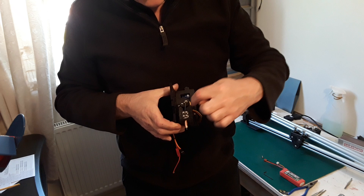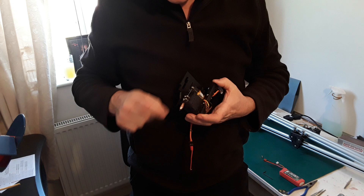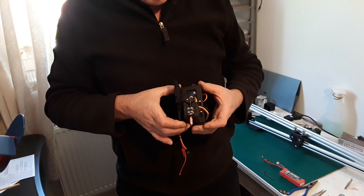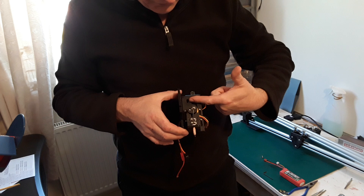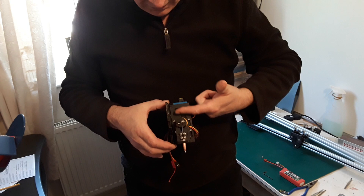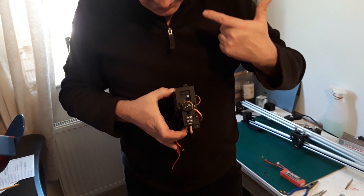The bearings are attached with M3 12mm screws going into the plastic, coming through into a MIG welding tip — I'm sure a lot of you have seen these tips on welding machines. I'm using that as a support for the actual needle. On the front you can just see a 9-gram servo, one of those cheap Chinese 9-gram servos you have on your foamy electric planes. When the servo arm is fitted it operates within this slot, and when the command from the CNC is given to raise the cutter, the servo arm turns and lifts this back plate up. When it resumes cutting position, the servo arm goes down and the whole assembly drops down.